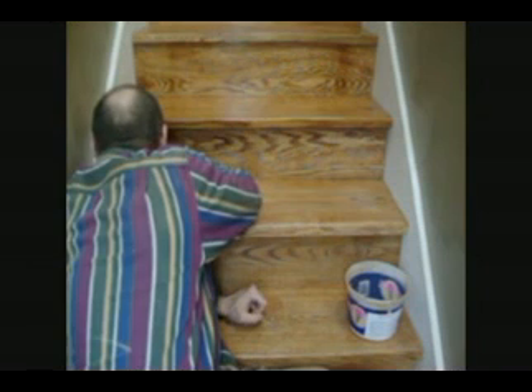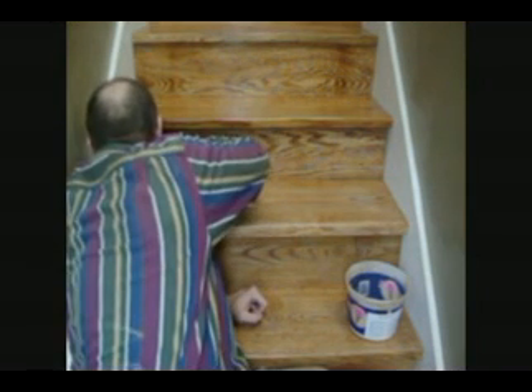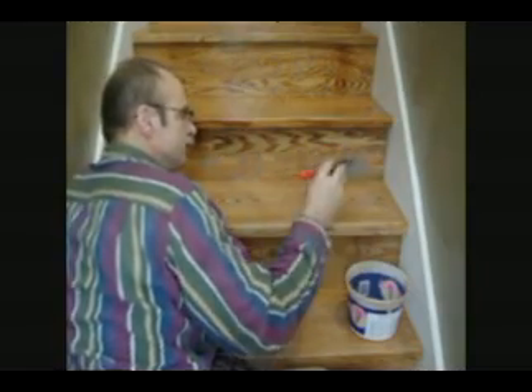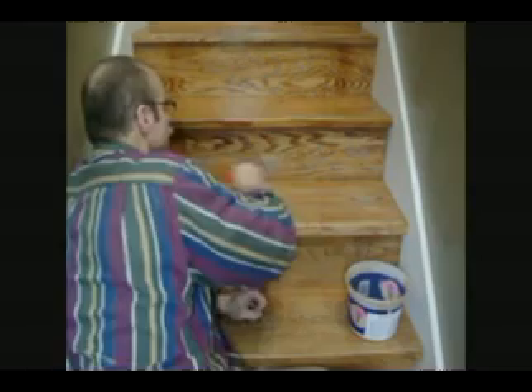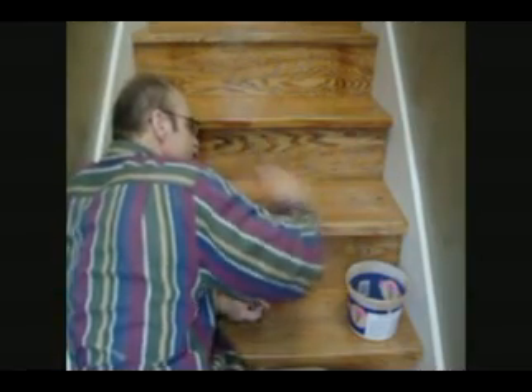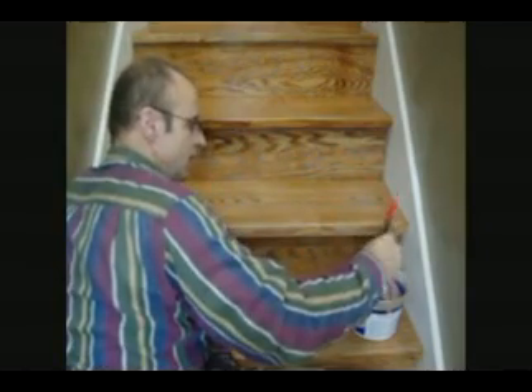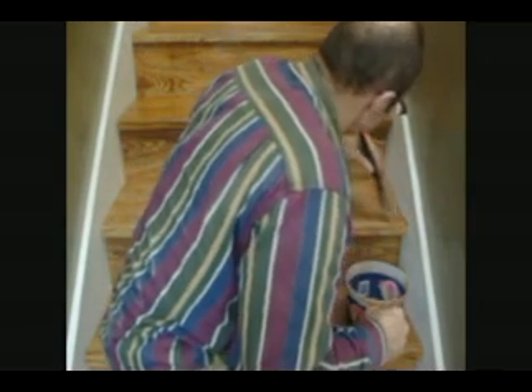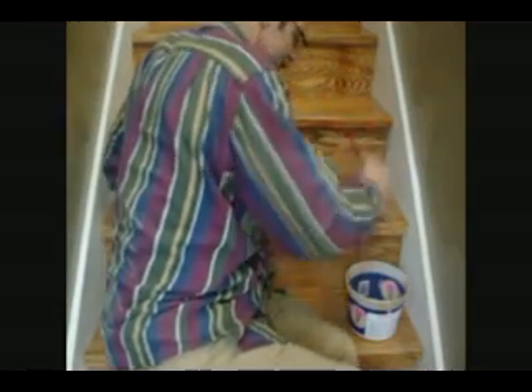I just go up and cut in on the edges — that's where the tapered brush is beneficial. I try to keep my wrist bending with the brush because if I don't, the bristles will slap this stuff all over the trim board. When I do the deck area, I cut in first on the stair trim and then work it back. You go with the grain — you want to make sure you're brushing it into the grain for the best results.